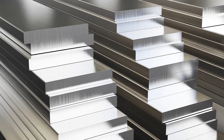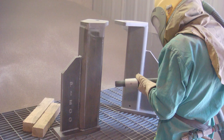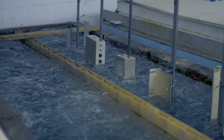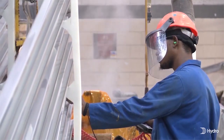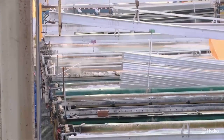Here's the current plan. The top and bottom case are going to be made from 6061 aluminum alloy, held together by magnets. They'll be sandblasted to have that smooth, consistent finish, and then powder coated. I know the popular choice here is anodization, but anodization is literally dunking metal into acid while running electricity through it. That's already kind of a stretch to do on my own, since I'm not trying to outsource any manufacturing I don't have to, which is ideally only the PCB.